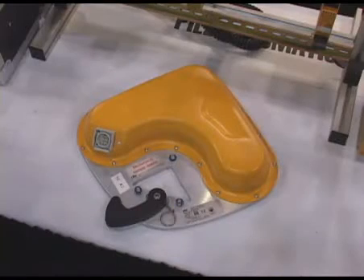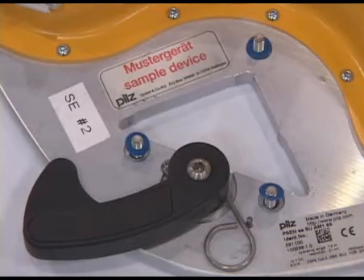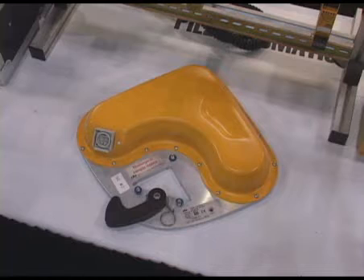to a dual computer rack, which provides the redundancy and the processing of all the video data from the three cameras to allow for a safe, three-dimensional, safeguarded solution for any hazardous motion in manufacturing environments.